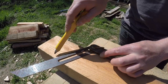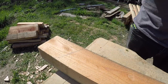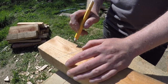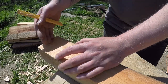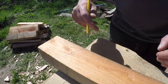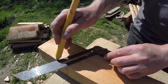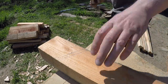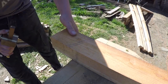Let's make some roof trusses. Roof angle, right there. It's gonna be a half lap joint, so this will be half lapped off and the other one will sit over it. We'll come in and sit like that, so we want to make sure I'm leaving enough — there's going to be a bit sticking out of that half lap because the other one's gonna come in here like that. I'm not quite sure that's enough, so we'll just stick a little bit extra at the end. Because we can always cut a bit off — a little bit longer than we need. Then we mark it halfway around it.